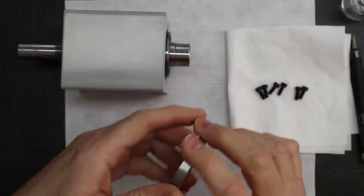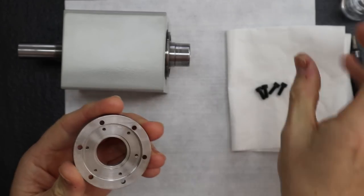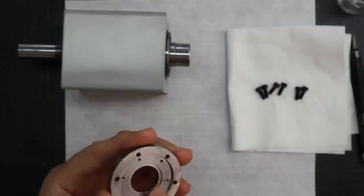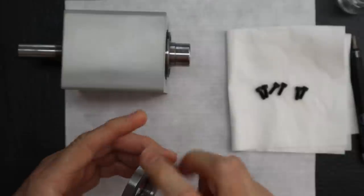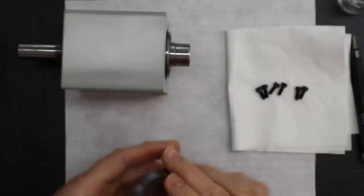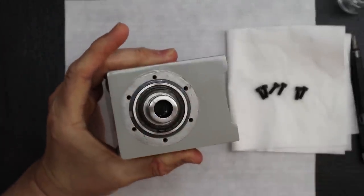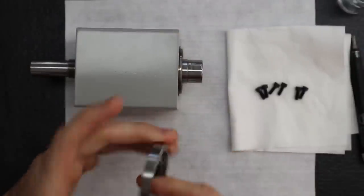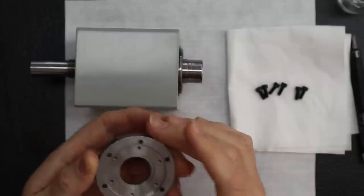And again, just a really light coat. And I notice even though you're test spinning this spindle all the time, your grease is still in great proportion all the way around. Just because you're spin testing, it doesn't mean the grease is flingy. Sure. So it looks really consistent all the way around. See, it all still looks good. We're just trying to avoid heat buildup in the end here during the break-in period, basically. That's right.